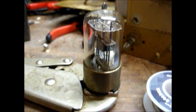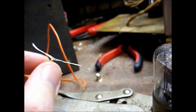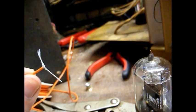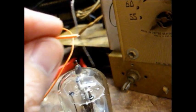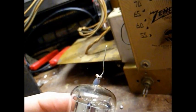I now have the tube secured in a pair of vice grips, very gently so as not to damage the pins. For an extension lead, I'll use a few strands of regular hookup wire twisted together and tin those strands, then attach them to this remaining little stub here and solder it in place. I actually found something a little bit easier to deal with than stranded hookup wire — just an old component lead cut off of an old capacitor.